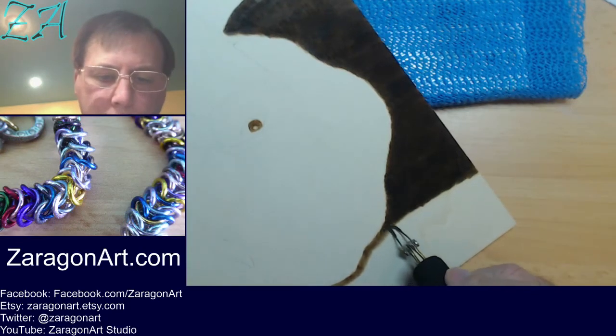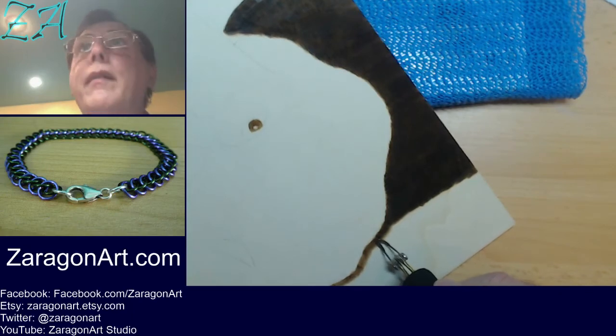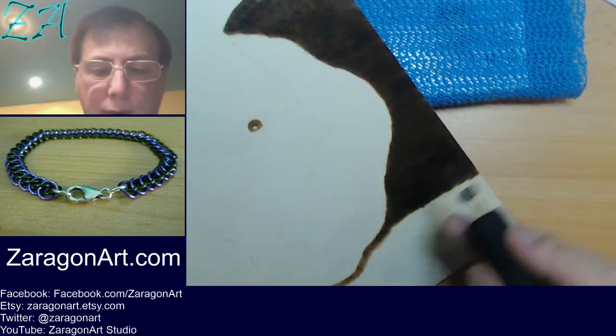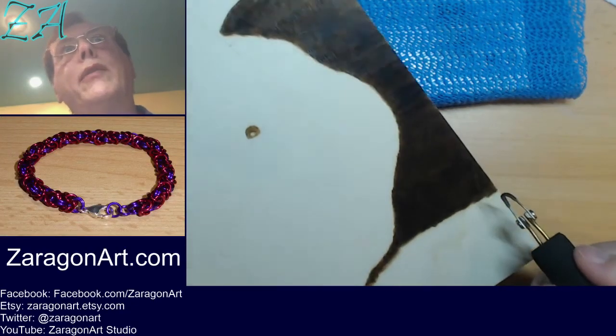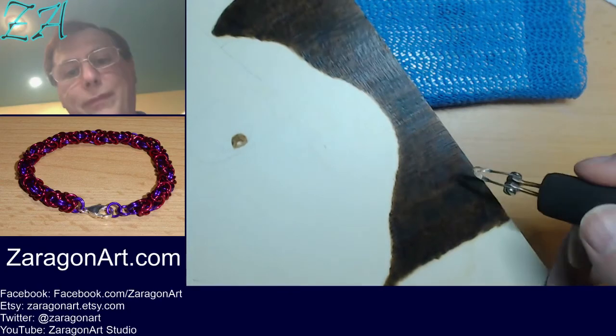Now the different areas of wood texture also have an impact on doing this. So the wood grain itself gets involved. You can just about see there's a line there, which is part of the ring structure of the tree that this top surface was cut from, and that slightly darker colour is actually harder to colour. There's less moisture in it, and it does show up often as a lighter area. You can see a line across there, which is the actual ring edge.